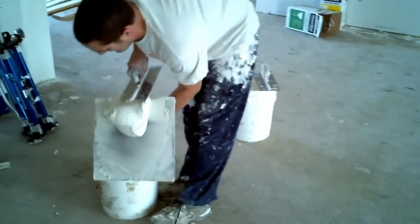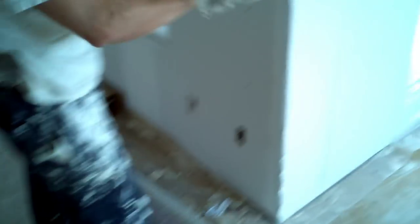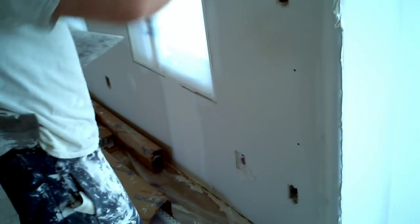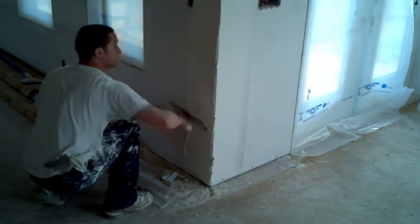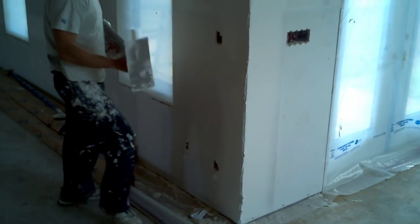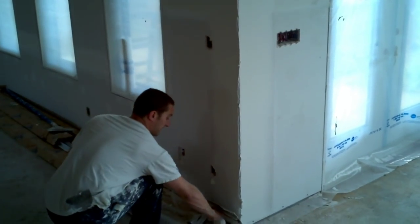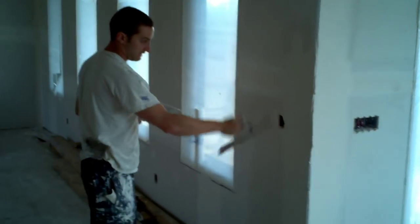Okay Phil, let's get this other side. He picks up a little bit of mud with just the tip of his trowel. This side I'm going different — this is easier for me to handle, I find it works better this way for me. I put the mud on and push it up flat. I squeeze against the bead there — it's all loaded. I'm going to feather it out. It's all next to straight. Now I'm going to use the flat and put it on a flat pass so that it wipes it all flat. There — now that's coated.